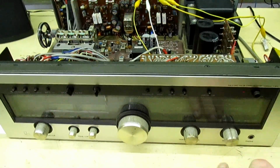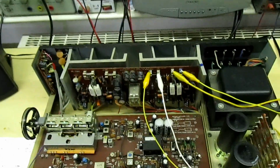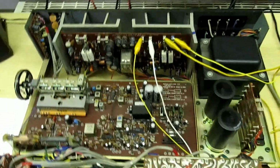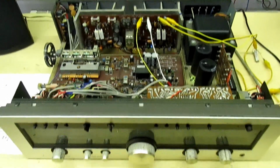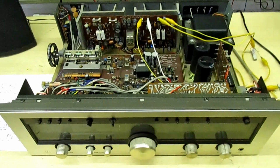Well, as you can see, 200 ohm resistors instead of the fuses. There's still plenty enough current passing to run this amp at low volume, so we can either leave it on soak test, or we can make more tests if it didn't work first time, and you're not going to cause any damage. It's not going to just blow up when you first switch it on.